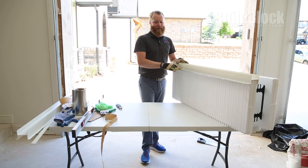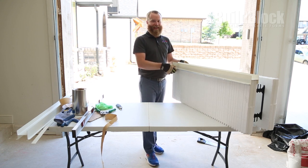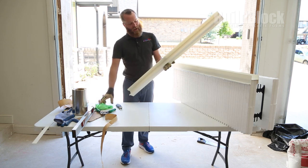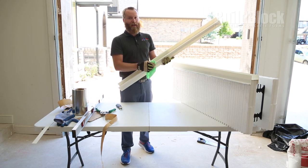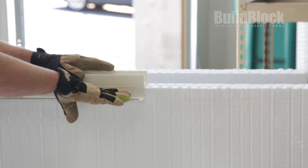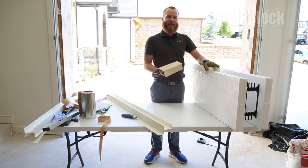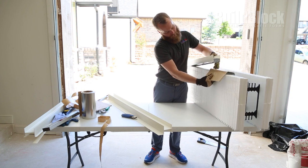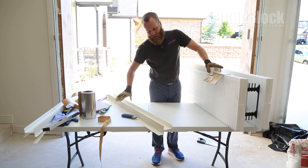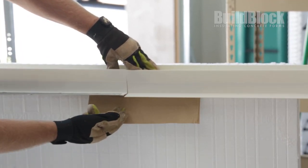It's very important when working with the steel adhesive that you only cut off enough paper backer for the section that you're working with. The adhesive is very powerful and can get stuck to other surfaces and damage the steel that you're working with. That's why it's very important to also make sure that you clean off any of the surfaces so that when you do use the steel it adheres very well. Occasionally you're going to have sections where you need to patch or create an overlap of two different pieces. It'll be important that for that patch you have two inches of continuous overlap. Once you have that in place, you can apply your next piece, cut your backer, and then do your overlap.